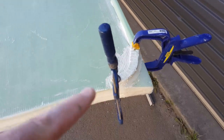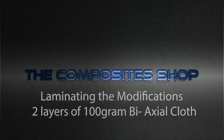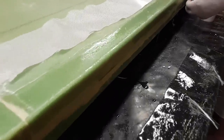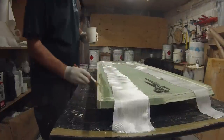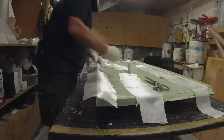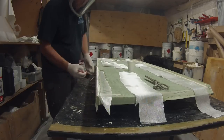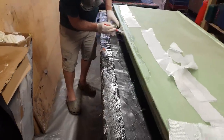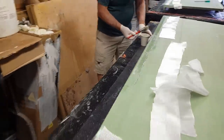Getting our first layer down - how good does that look! Beautiful, smooth, nicely faired. We've done some serious prep on these - probably two or three days of prep to get to this point. Just stipple it on, try not to brush too much - we want to make sure we just get it in there. I'm going to roll it in a moment with a fin roller, put two layers on, and then roll it to make sure we end up with no bubbles and she's all wetted out.